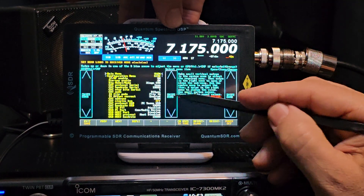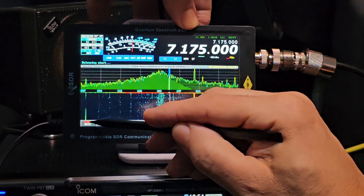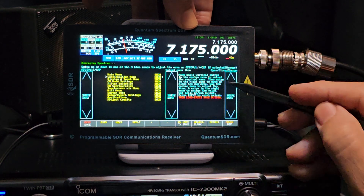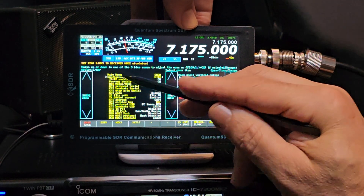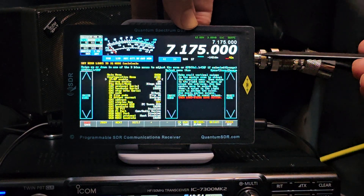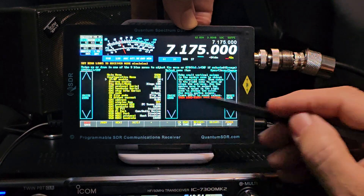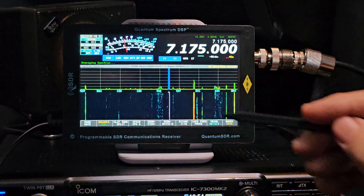Go down to configuration. Hit the menu, go down one — if you go too far, just keep going. Down one, then open. I've actually enabled the preamp, not that it really needed it. You'll see 'IF RF enable' — that's on at the moment. Turn it off — you're effectively turning the RF antenna off that's going into this device. And then just turn it back on, and then just save, and then exit. And that's it — you've got your signal there.